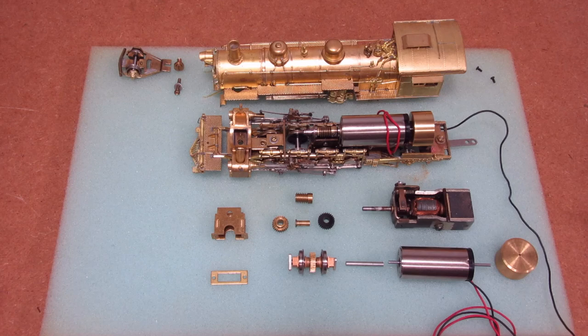That's about it — that's how I remotored my K37 after I rebuilt it, and it just runs amazingly well. I'll have to get some video of this hooked to a DCC controller. The low-speed limitation is really the fact that these motors will start rotating at such low voltages that it's actually kind of hard to get good conductivity between the locomotive and the track. But if you're running DCC with 16 to 18 volts going through the track all the time that really helps a lot, plus a lot of controllers use pulse width modulation anyway, so that really helps with the low speed performance.